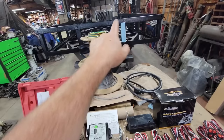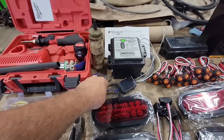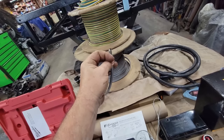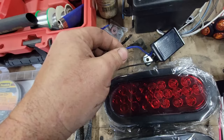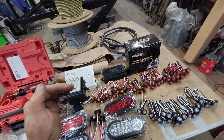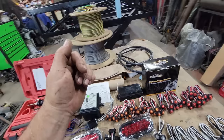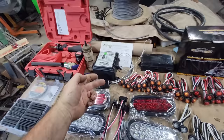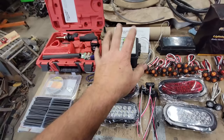The gauge of your wire can affect the amount of amperage and voltage drop that you get to where it's going. Think of having a great big wire and running a little bit of electricity through it — you're never going to drop any voltage no matter how long you run it if you only need two or three amps. But if you were running 50 amps through a small wire, it couldn't handle it and would melt down. The big thing about wiring is having enough conductors so enough electricity can flow without the wire's resistance affecting the end result. It's like a garden hose — if your hose is crimped somewhere, you're not getting as much water out. Wire resistance is basically a restriction.